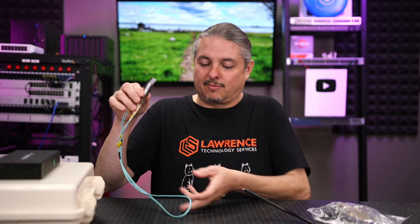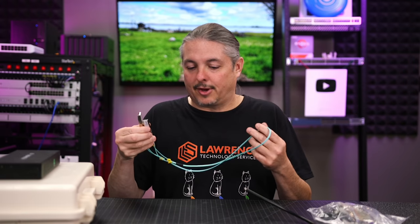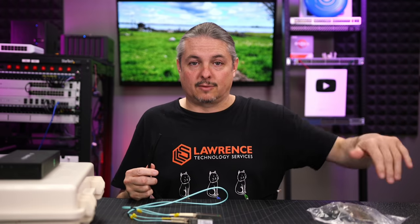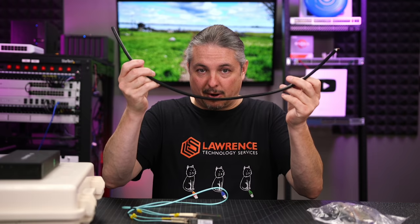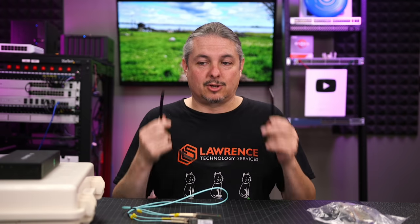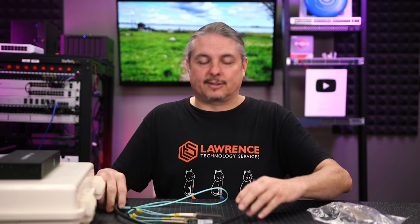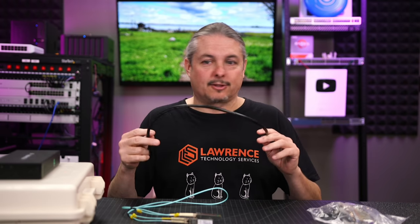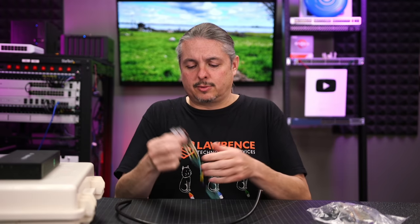With the comments of why not fiber, I figured why not talk about that. First, this is just Wi-Fi for a dock. Second, they were already going to be trenching because they had to run other service lines out to the dock. So we already have direct burial cable — this particular one from Game Changer is the direct burial version, which means it's a little more expensive than average. You have to check with suppliers to get it — it's not sold on Amazon. It's usually sold by large cable vendors.